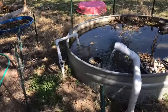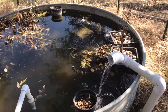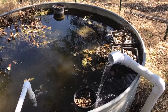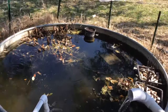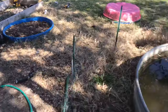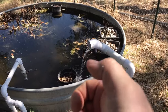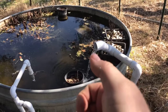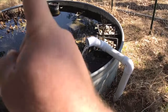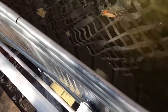You can see the way water is coming out of that two-inch piece of pipe - it's just kind of dumping out, not even filling the full volume the pipe is capable of. But if I were to put a reducer on there and reduce it down to, say, a half inch, the head pressure would be shooting water way back over there. That's the same thing that happens when you put your thumb over a garden hose. To make water go further, you reduce the opening relative to the pressure and you get greater pressure.